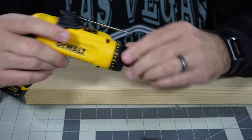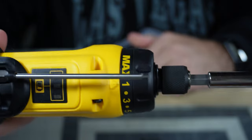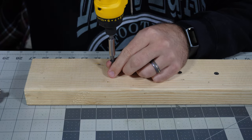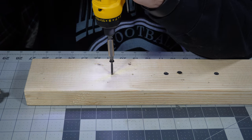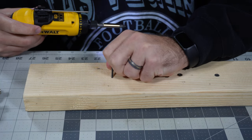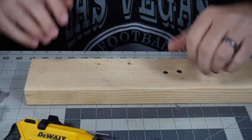That could potentially be a problem if you're not paying attention. Now switching to the DeWalt — I like that quick connect, and the fact that it's locked in so it won't come out accidentally. We're on setting one; there's no hole so we'll just get it barely started. I know this clutch is very sensitive so it's not going to drive this screw nearly as far in. And that's it — it barely started; I can probably pull it out with my hand. Yep, I was able to pull it out by hand.